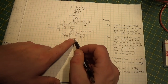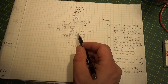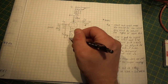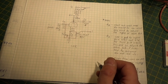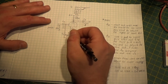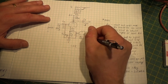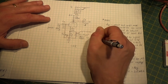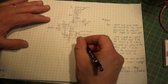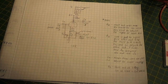The other thing: if you do use the bypass cap, it is an electrolytic and it is polarized - make sure the negative goes to ground and positive goes up on the cathode end. I choose 63 volt rated capacitors. There is usually nowhere near 63 volts there, but 63-volt capacitors have relatively low ESR compared to a 15 or 25-volt capacitor. I do that for added protection of the higher voltage but also for the lower ESR - it'll just make it function a little bit cleaner.